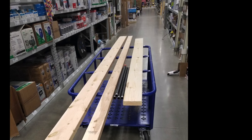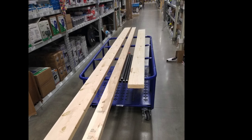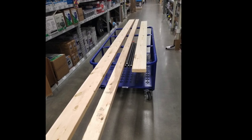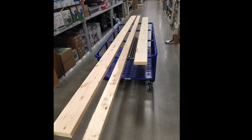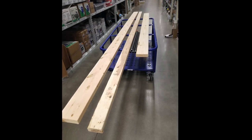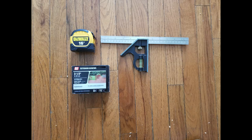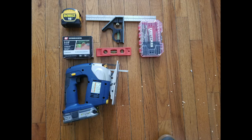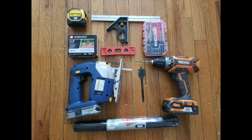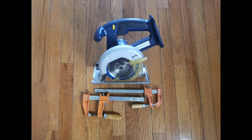The tools and supplies you'll need: I went to the hardware store and bought one 2x6x8, one 2x6x12, and one 2x4. If you don't have all the saws that I have, you may want to have them cut as much of the wood for you at the store. I also designed the unit to be 29 inches wide so that when I bought the 3/4 inch black pipe, which comes in 10-foot lengths, it would equally divide into 30-inch pieces — they threaded that for me at the store. Other things you'll need: a tape measure, a square, 2.5-inch wood screws, a level, drill bits, a jigsaw, a 1 and 1/8 inch spade drill bit, a drill, shelving traction paper, shims, a circular saw, and some clamps.